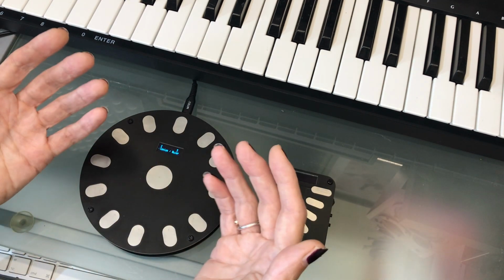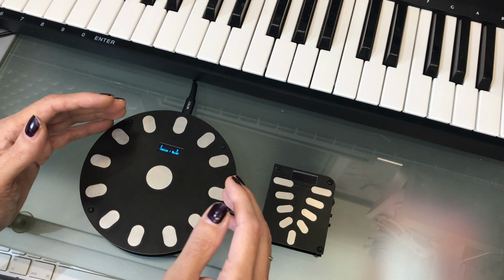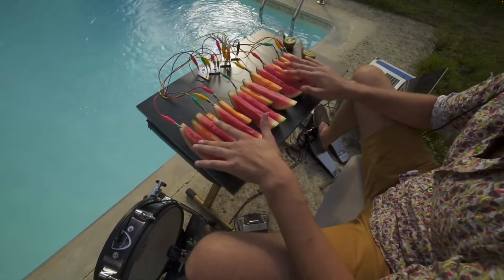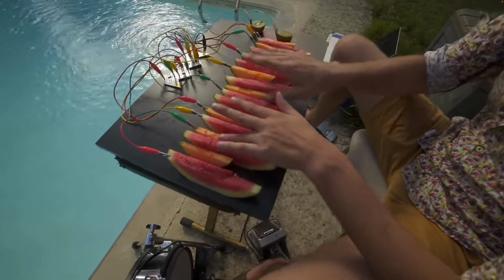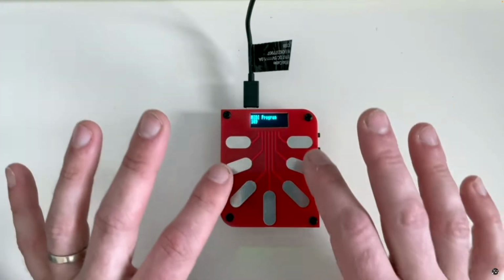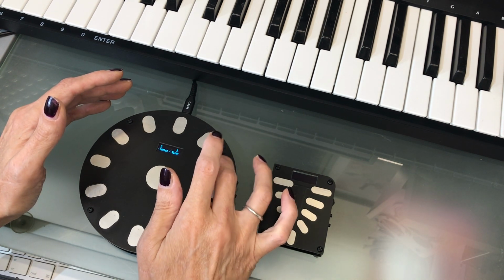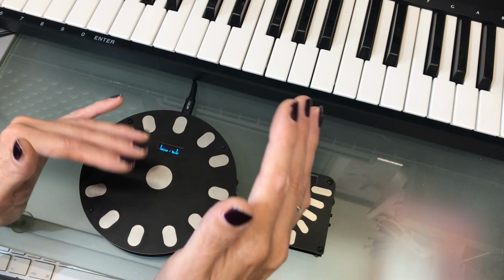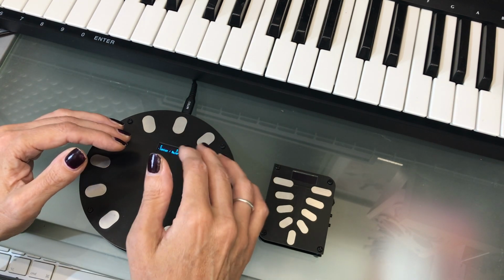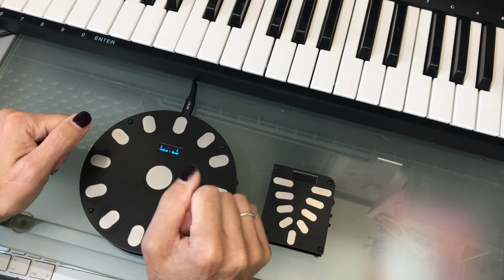This isn't an excuse, just the story of how these things developed. The prototype didn't even have velocity sensitivity. The capacitive touch chip that I use is really aimed at producing triggers, so it didn't cross my mind initially until Kale, my collaborator, suggested it. I was very happy to get something working and to even have some difference in sound level and quality according to a light or heavy touch. Added another dimension, turned this into an expressive instrument. At the time, that felt like quite an achievement.